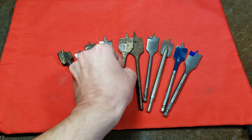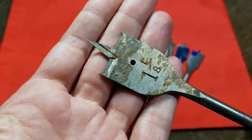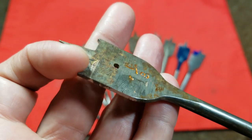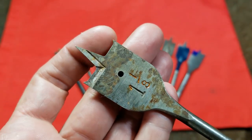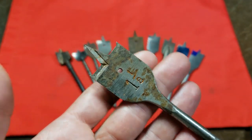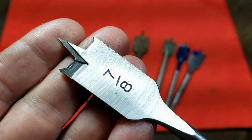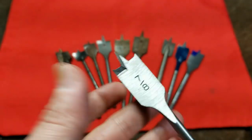I would think the very next step up from the most basic are a couple of different choices. I'm not exactly sure of this brand, but the slight upgrade is that they've stamped it there just to provide a secondary kind of relief, as well as putting in these spikes. I believe what these spikes are — as reading from the forums — is they provide a pre-cut just to help make a little bit of a smoother finish in the bore. We even have a Master Mechanic, where that stamping and little under-relief area is just a little bit deeper and more aggressive.